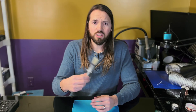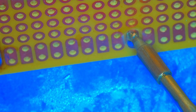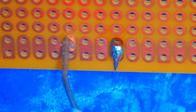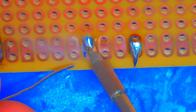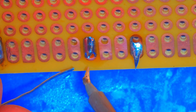You can expect to spend about $10 to get a roll of leaded solder. And you also can't solder without flux. If you're like I was about a year ago, you might be wondering what flux is. All I know is that it makes the solder flow properly and makes good connections. Without it, your solder is going to form peaks and make really bad connections. But with it, even your solder joints can look professional and better than factory. Expect to spend around $15 for a syringe of flux, and if you're only using it once a week or so, it'll last you a good long while.